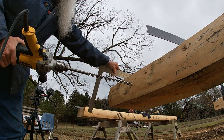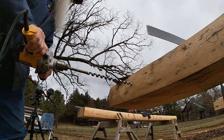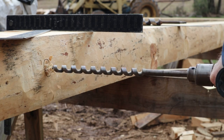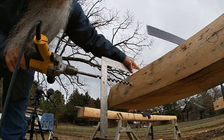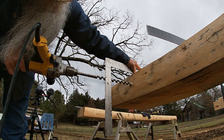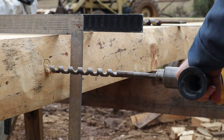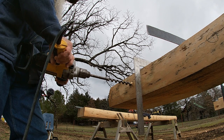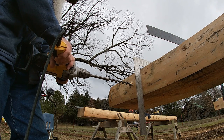This log is still leveled up — it hasn't been moved — so I'm just going to start drilling. I stop and check it again just to make sure I haven't moved anything, and I seem to be pretty good. On these ship augers, I've found that once I get started, if I put just a little slight back-pressure pulling on it, it seems to help drill straighter because these bits will flex.